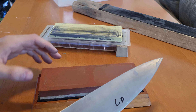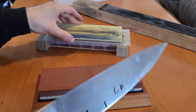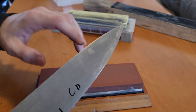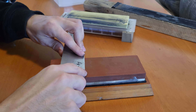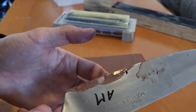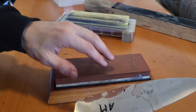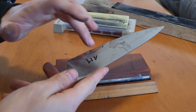Now we're on to our sharpening test. I've taken my kitchen knife, which has been a victim on this channel a few times, completely dulled it, and divided it into different sections so you can see which side I'm sharpening with which stone. We'll start with the 1000-grit side on the Amazon stone and then the 1000-grit side on the Japanese stone. Since the Amazon side is coarser, it should go faster — but we'll see how the quality of the grinding material holds up, and which takes the most or least time. We'll use only the stones without a strop and test by cutting paper.